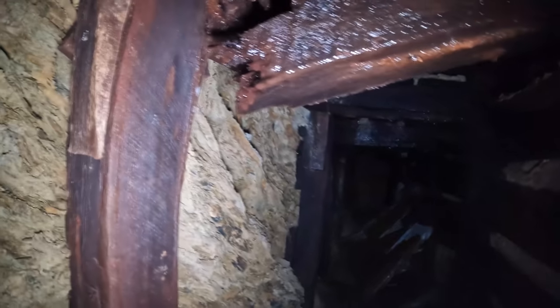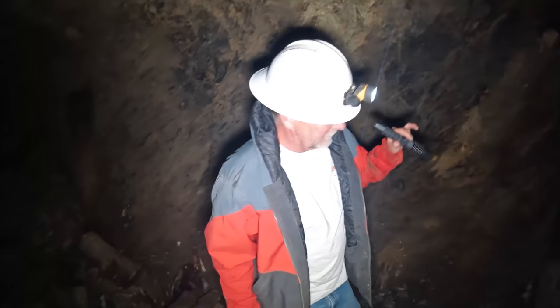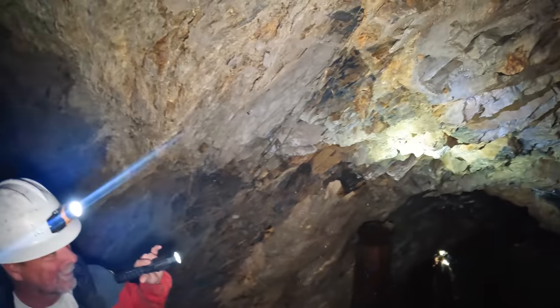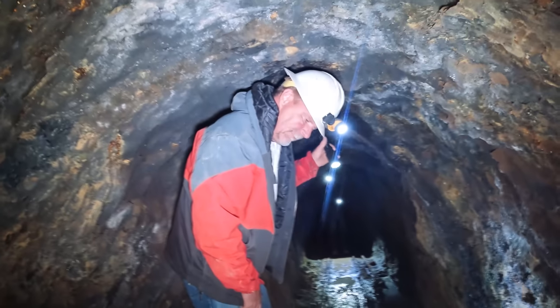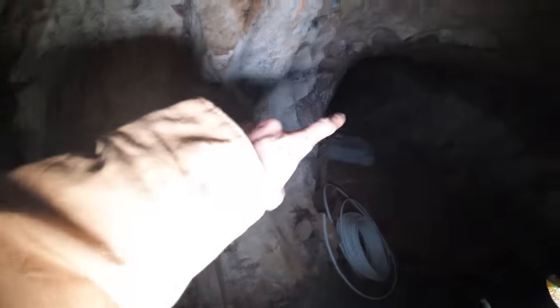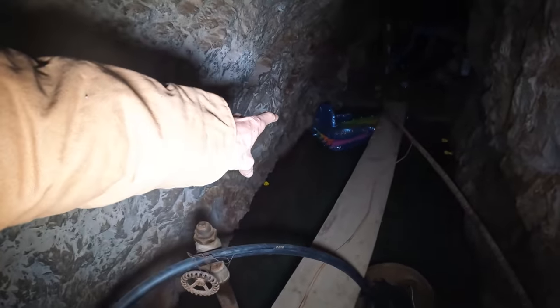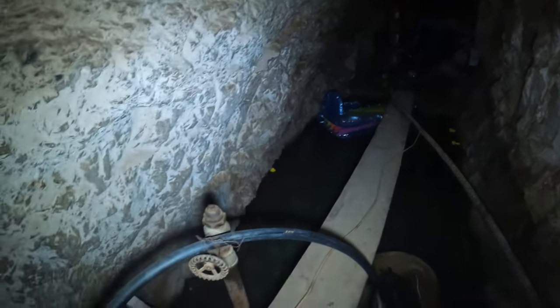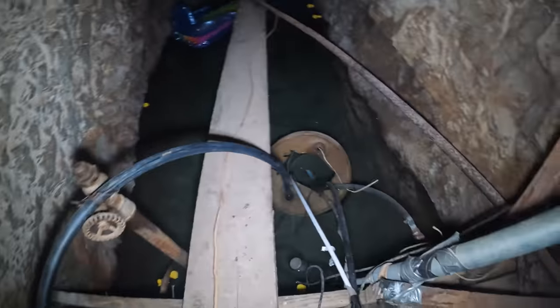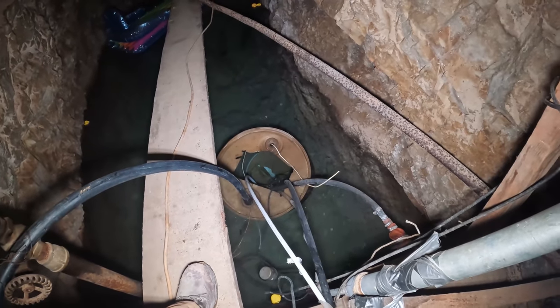And there is your water, just dripping. This is where all our town water supply comes from, and you can see it's really not flowing. This is why we can't put a big pump in this system — we don't have the supply to refill the pool. This is where all that water from back there ends; you can kind of see it coming in there, dropping into that barrel. We think this is about 3,500 gallons, and you can keep a high watermark on the side to track what's going on. This is all we got — it's not flowing quick, it's not replenishing quick. The reason we have the system that we do is because of these factors.